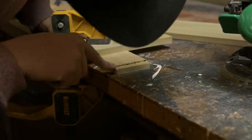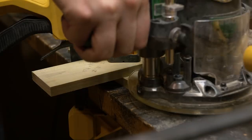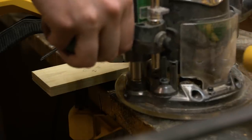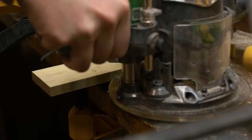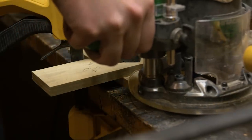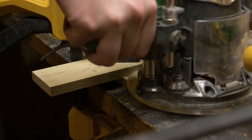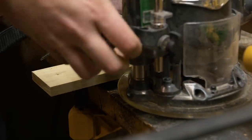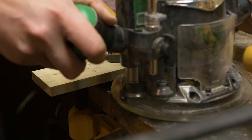Whenever I use a router, the two times I've used this one, I feel like I'm using it wrong. I have this massive router on top of a 2.5 inch wide board, and it tends to fall over when I get close to the edge, meaning the bit digs into the side of the wood. Maybe I need a smaller router with less weight for delicate operations like this. Or maybe I need a table saw, which would make very light work of this kind of operation.